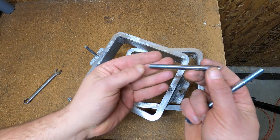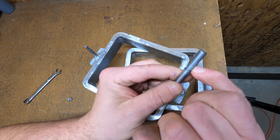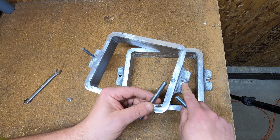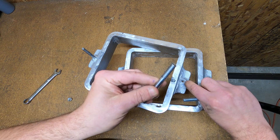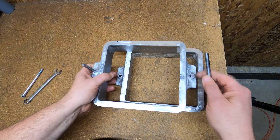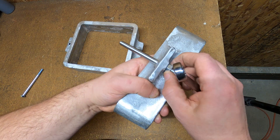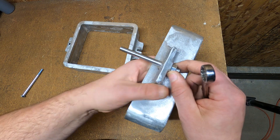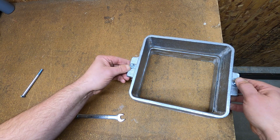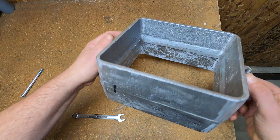Here's the pin — it started out as a 5/16 bolt, still is a 5/16 bolt with slight modifications. Here is the little shoulder: I turned the threads down, tapped this with a 5/16-18 tap. This little shoulder should just catch on that milled flat. Put this last one in here — threads are a little long, I'll end up cutting this off. This one's ready.